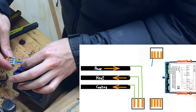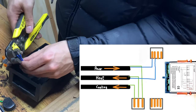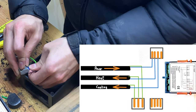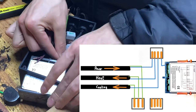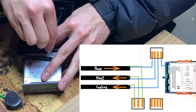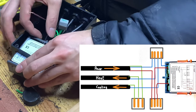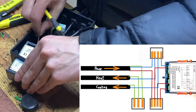Then I connected the neutral wires together using the same method. The neutral wire from the power supply is split into three ways: one for powering the thermostat, one for the cooling outlet, and one for the heating outlet. The live wire from the power supply is also split three ways: one for powering the thermostat, and the other two are connected to the thermostat so that the heating and cooling outlets can be switched on and off by the thermostat.